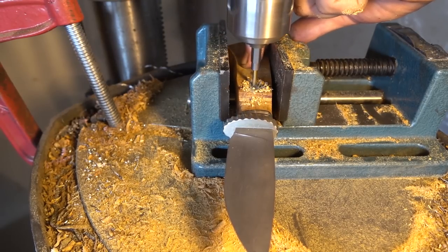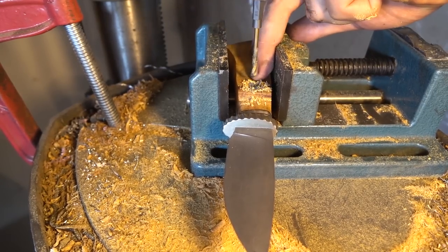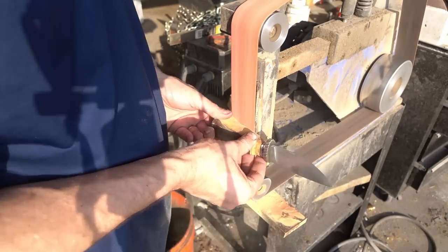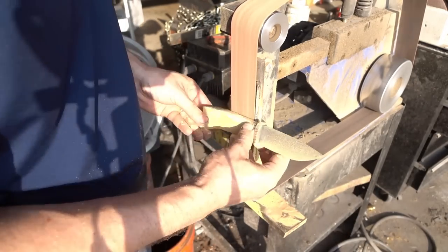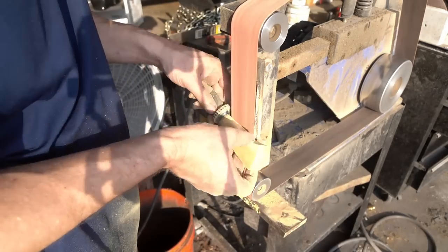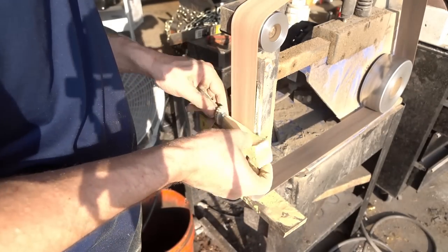So here it is made with two rings of mild steel just under the guard area. It's been glued up at this point and I'm drilling a handle pin hole. The bocote handle material is going to be shaped on the belt sander and then sanded to 800 grit.